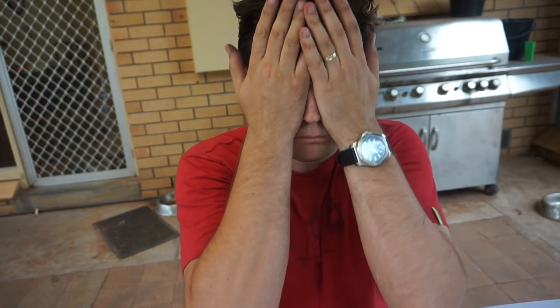Alright. So the toothy edge did make it feel like it was biting in a lot easier and made the cutting feel a lot easier, and it did last a fair bit longer. But it's still now lost its paper-slicing sharp edge after 80 passes. So that's nowhere near like the Work Sharp versions of other D2 that have done this test. Even the Viper Keeper, which I don't have now - it's between here and America somewhere and someone's bought it - that was an underperforming D2, and this appears to be one as well.